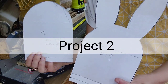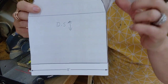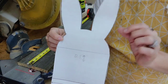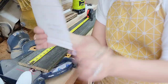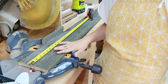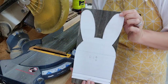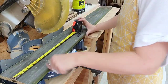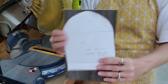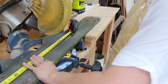These are the templates from my bunny boxes and I'll have them linked in my Teespring store if you would like to purchase them for download. I always write the measurements on my templates. I need a 12 and a half inch board for the head of the bunny and a nine inch board for the booty of the bunny. I am using fence boards for this project — all the measurements will be about five and a half inches wide, which is the approximate width of a fence board. So I need a 12 and a half inch piece, a nine inch piece, and then two 20-inch pieces for the sides of the box.